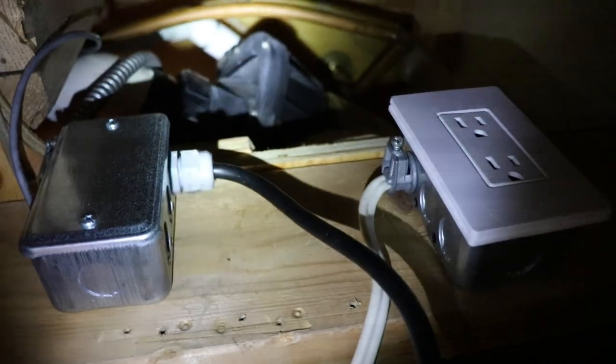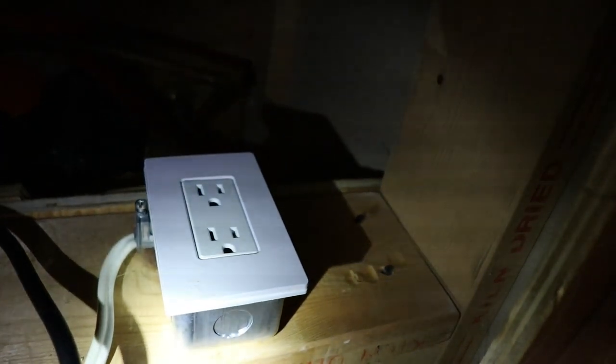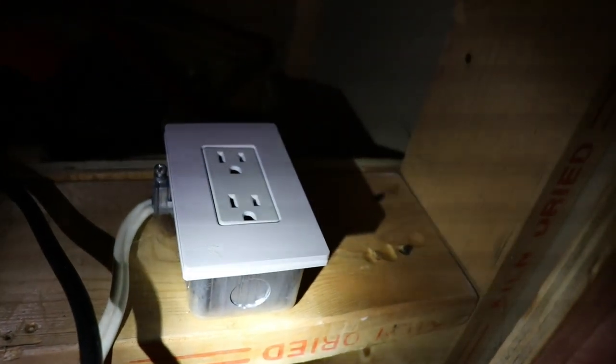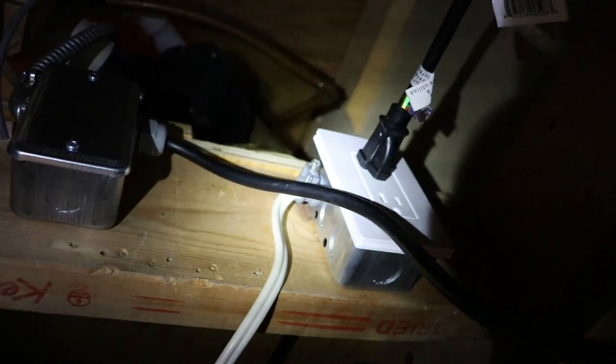So we'll crawl up here. That's the cord end I added to the motor. As the armor cable comes out of the motor, I just put a little junction box here and put a cord end with the connector on there, so I'll plug that in. This wire comes from the house wiring - it used to go into the ATS-100, so I just put a receptacle on it. This comes off of the GFI that's up in the bathroom. Basically, once you do this you can test your motor because you can plug it in. It's not going to start because I have the circuit turned off. But once you have the cord end and a receptacle, you'd be able to plug it in - and it would run continuously, which is no good. You've got to have a controller for it.